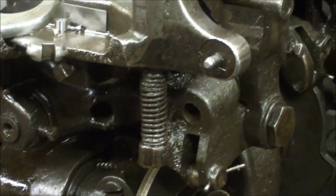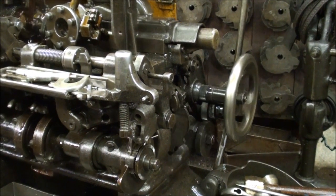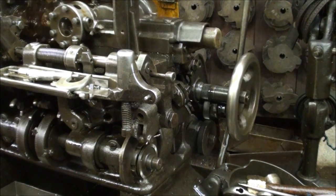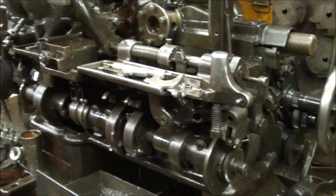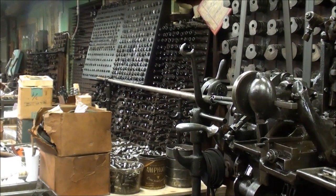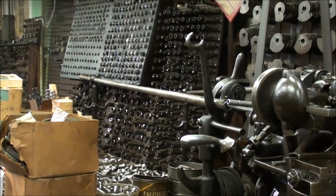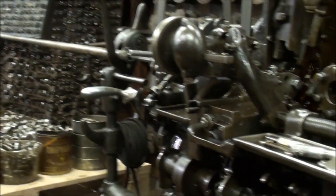Nice little spacer, and the special OD, and the ID is a special 217 — I had to use a millimeter drill. And this is a Brown and Sharpe, what — it's a double-ought, we call it a double-ought. I believe it's from 1946, and it's being fed with a bar feeder. The diameter of the stock is 5/16, and this is 12L14 steel.